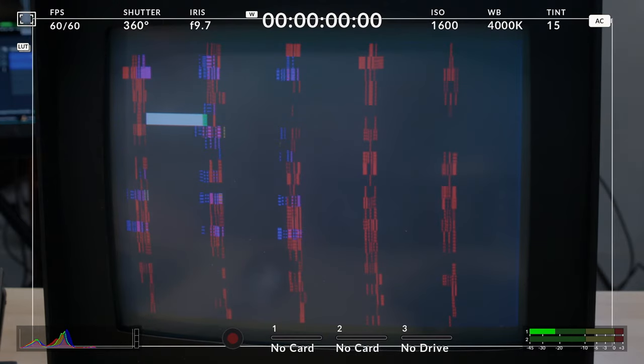So, all the VHS filters I've ever seen, I don't even know where they come from, because all they are is just separating the color channels. That's impossible. That cannot happen. VHS does not work that way. It does not think in terms of red, green, blue color channels. That is a modern thing. That is a 2000s thing. It thinks in terms of phase. It thinks in terms of phase difference from a reference frequency. So you simply cannot, period, ever have that kind of glitch. But more importantly, no one would ever think that that looks...